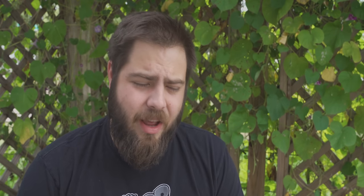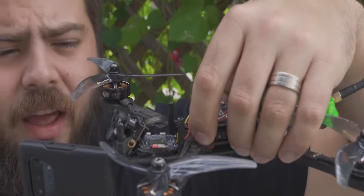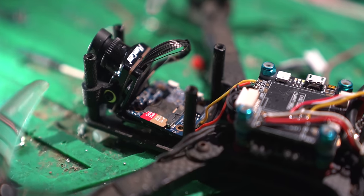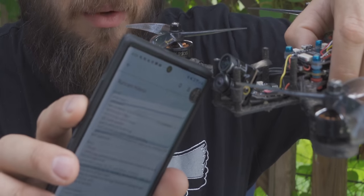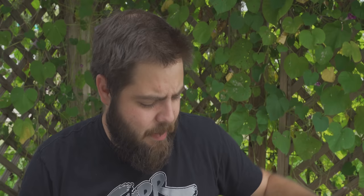The camera bit — the two lenses — is very tall. If you're running a super low frame or anything like that, it's going to be really hard to fit in there, and even harder to be able to tilt it. If you're wanting to run like 50 degrees, you're going to have to have a lot of room in your build for that camera to swivel way back. That being said, they did put in two screw mounting holes — a high one and a low one — so you can change how it's mounted depending on the type of flying you're going to do. That will help you fit it into more builds, but it is still a pretty big factor.